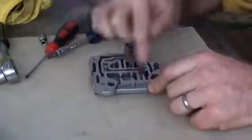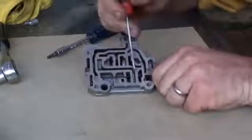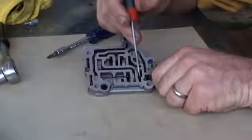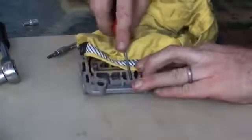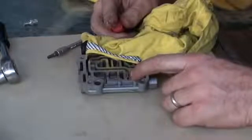In addition to that, there are some components that have these little clips — there's a little clip that actually holds in the multiple components. There might be some springs up here, and it's actually holding another piece in place. To pull these out, use a small screwdriver, but make sure you're protected. We're going to lever this out, but we don't want to be scratching the surface, so use an old rag and lever that up — it will just pull straight up and out. These are actually orientated in a specific direction, so make sure you take photographs of this, noting which way it goes on the way back in.